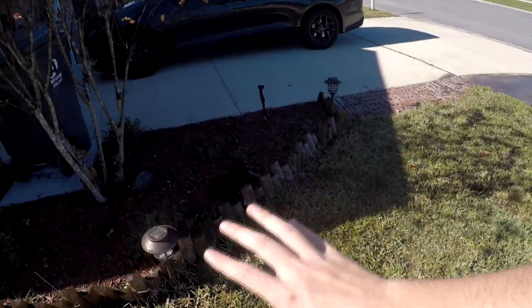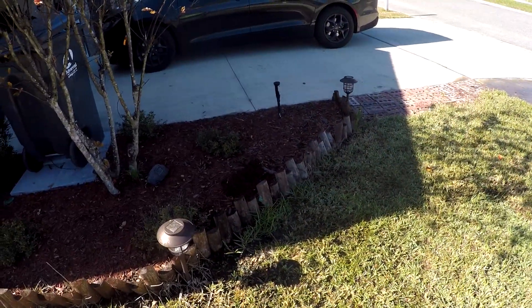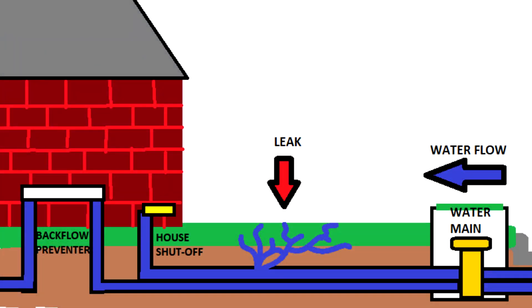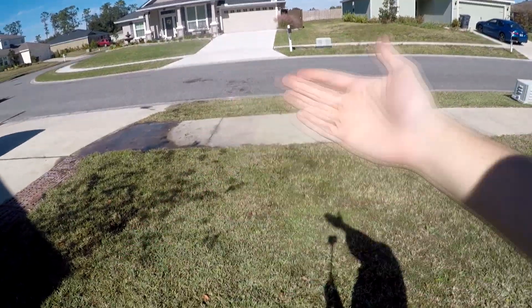The other issue is since this whole area is leaking and wet and damp, I'd have to rip up about 20 square feet to try and pin down where the leak is really coming from. You could say, 'Brad, why don't you just shut off the water, let everything dry out, turn it back on and see where the leak is?' Well, that's what we've done. With the backflow preventer, I've turned that water off, but that only helps leaks downstream of the backflow preventer, which I don't think this is. So if this leak truly is before the shutoff to the house and before the shutoff to the irrigation, there's no way to turn anything off. I don't know where the city shutoffs are and there are no boxes there.